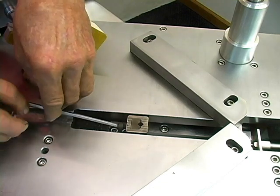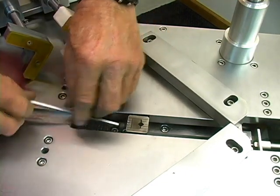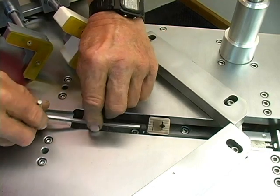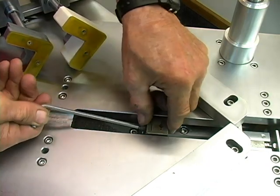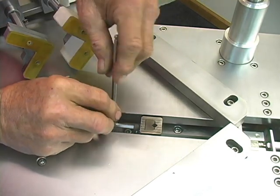Grab the 15 millimeter head and drop it into position. Take your wrench and take the slack out of the bolt. Finalize the tightening with one eighth turn of the wrench. Now you're ready to take on that thicker molding with the longer V nails.